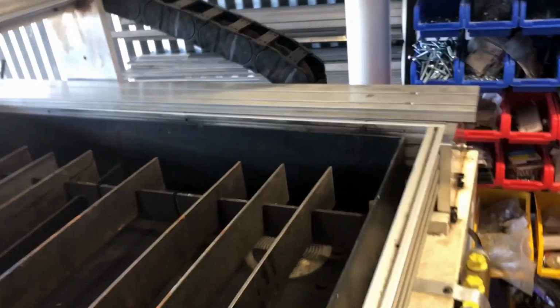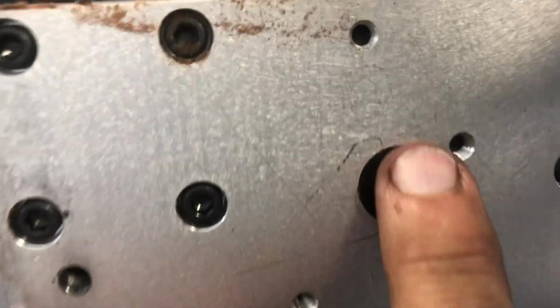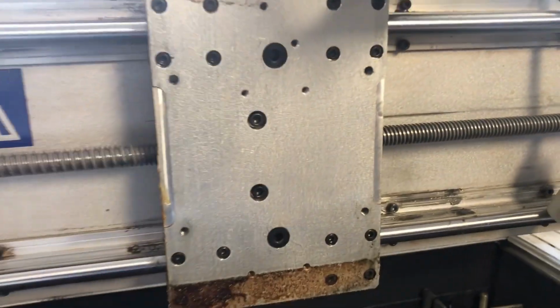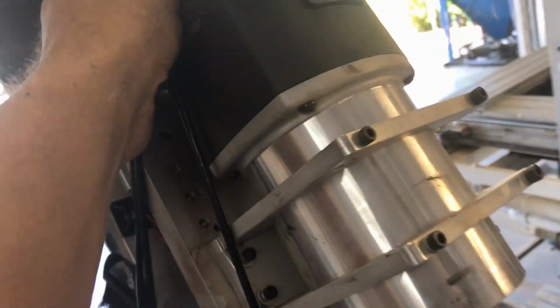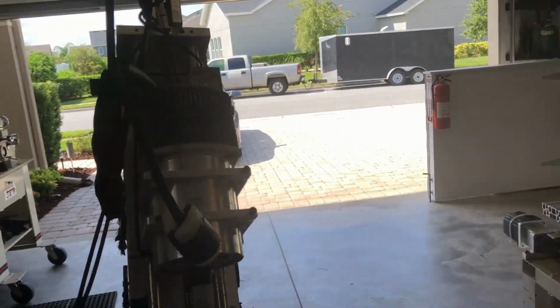Now the trick to make this work is that I've got these locating pins right here. You see these are the female portion, and I'll spin the Z-axis around, and you can see the male locating pin, so it's like a fixture. So it just locates on those 2 points and then attaches with 4 screws, and it quick disconnects, so I can just slide it out of the way. Gotta use my hose for everything. And the Z-axis is free from the head.